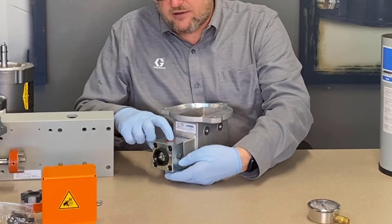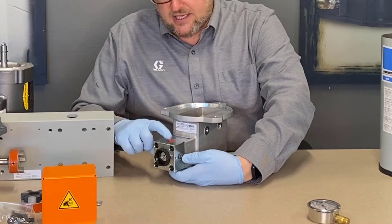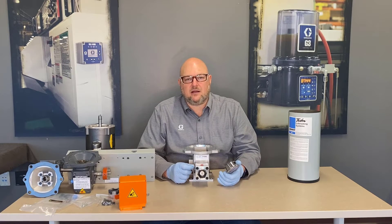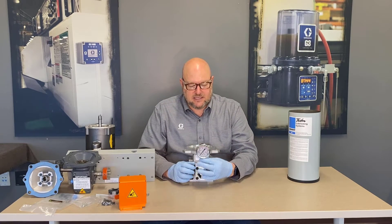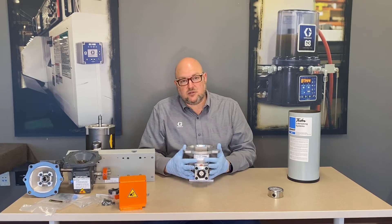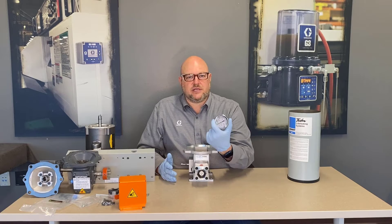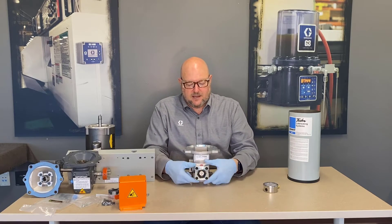This output manifold around the hex has four quarter-inch NPSF ports that receive NPT or NPTF fittings. The gauge port is on top. When you order one of the systems by the LM part number with four digits after LM, the gauge is always included. However, it's sold separately if you buy the unit as individual pieces. You can either order a complete assembly by the smart number or order individual components and build it up yourself. If ordering components individually, you'll need to get the 557713 pressure gauge and install it yourself.